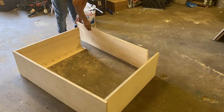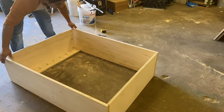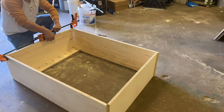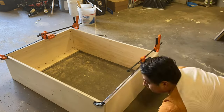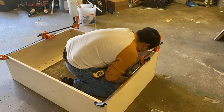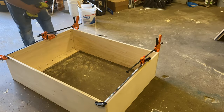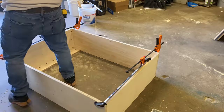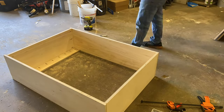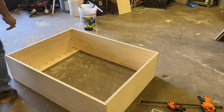I took my side panels and measured an inch and a half up — that's where the bottom panel will align so it won't be flush, giving you that little box area underneath the cabinets. It probably should have been about three inches, but I didn't realize that until after I was done. I used clamps to hold it together — I put two together since I didn't have a long enough one. Don't forget the wood glue when putting it together; make sure you're using both wood glue and the screws.